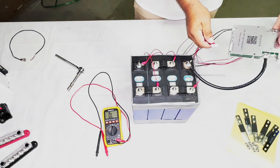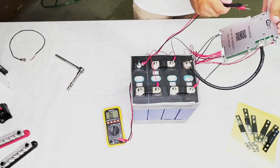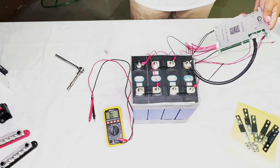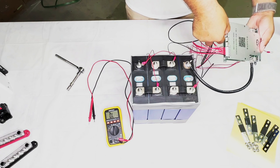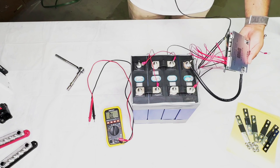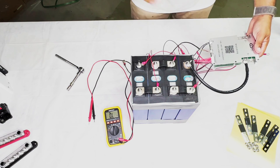Take the balance wire connector and plug it into the back of the BMS. To start the BMS you can use a multimeter on continuity test — put one probe on the P-minus and one on the B-minus side, and that will start it; if it doesn't work, swap the probes. We include a start button with all our BMSs to save trouble — it plugs into the back of the BMS. Push the button and you'll hear a beep and see a red flashing light, meaning the BMS is active. Now you need to go in and program the BMS.